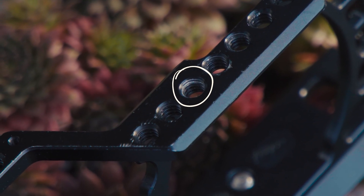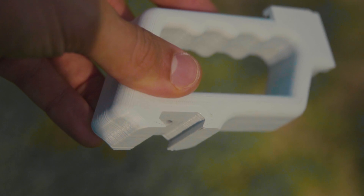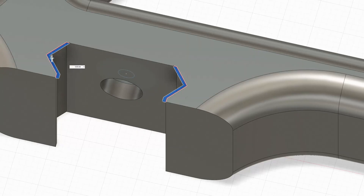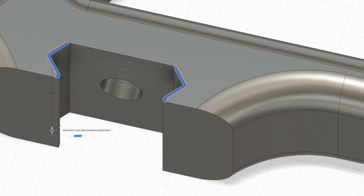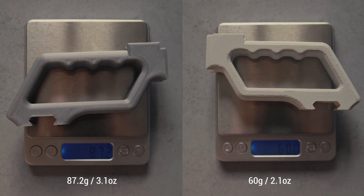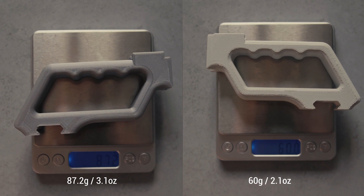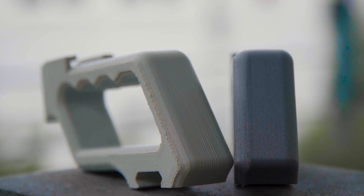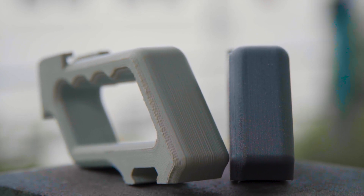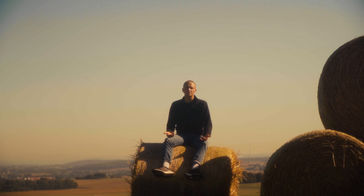It was the cage that failed — the quarter inch screw ripped out the cage's screw thread. After that, the NATO rail mount on the top handle deformed, but I had already made that part more sturdy by lowering the tolerances. I didn't even test the stronger top handle because it was obvious that the weakest link in the chain wasn't the plastic of the top handle. I think a lot more force is withstandable with a longer screw. As for which one I will use: the 100% infill version is heavier but has a nicer surface finish due to the more expensive filament. Since I like to save weight, I'll go with the cheaper top handle, though the difference is just about one Euro — so it's really a matter of preference, not price.